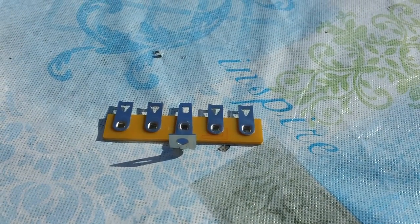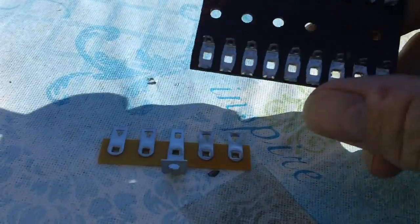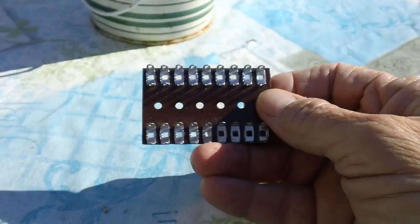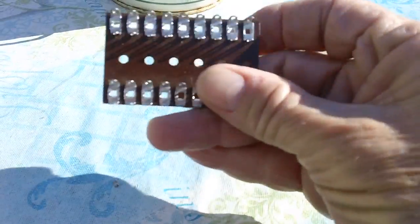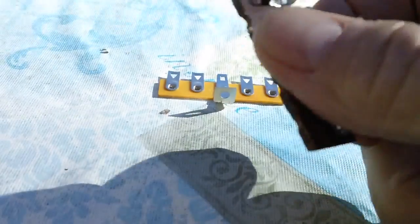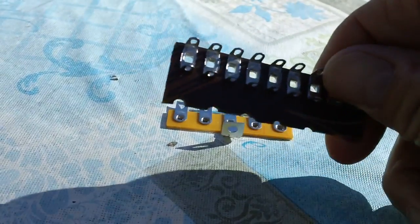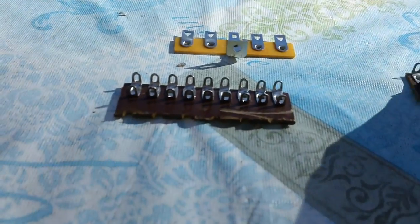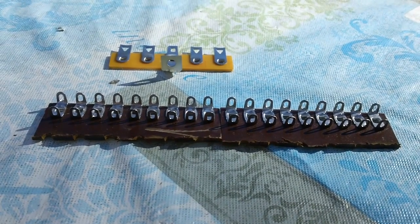Most people were selling them two and three at a time. So what I decided to do — I looked around on eBay and found this little jewel here. This is kind of neat. I was hoping it would be a little larger, but unfortunately it wasn't. So what I'm going to do is split that right down the center. There it is split down the middle. I'm going to go ahead and take a sanding disc and smooth that up real good so it looks fairly decent. When I finally put the two pieces together, they'll be butted together and I'll have myself a nice long terminal strip — just what I wanted.